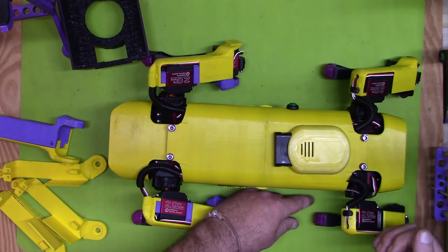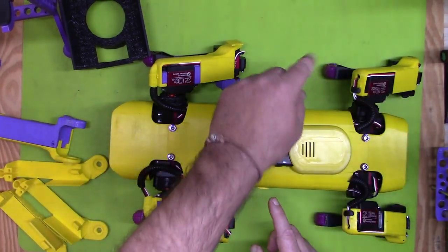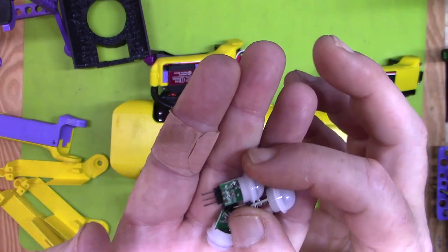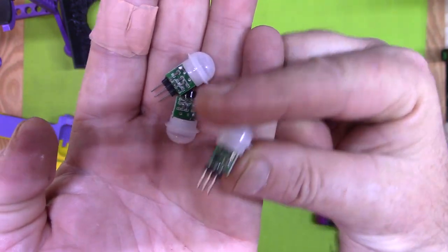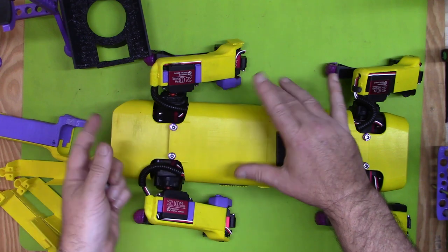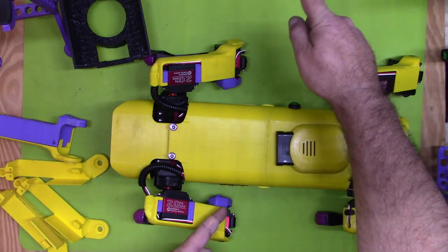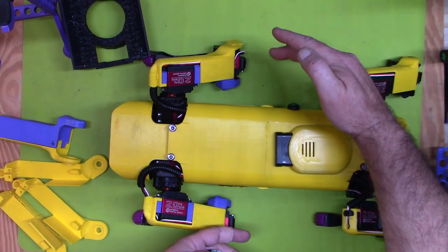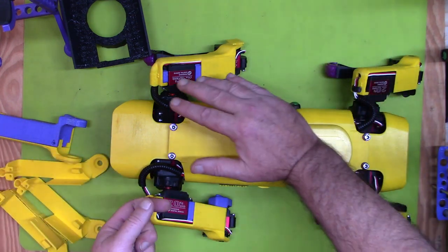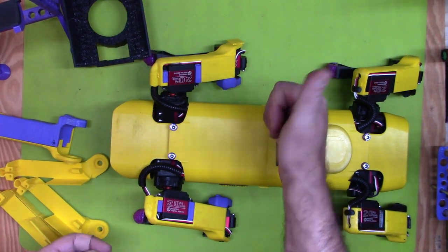They're pretty accurate — if I move my hand around the side it won't detect me until I clear the view plane, so with one on either side and one in front, each should have its own clear detection zone. I also scored some nice small ones with the circuit board and terminals facing in a great direction to plug right into her sides and front. The plan is either obstacle avoidance or having her follow you — detecting when a human gets close and using the three sensors for trajectory tracking to turn and walk toward you.